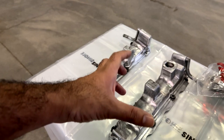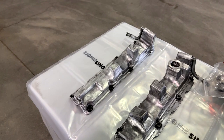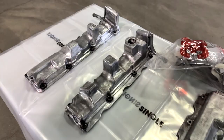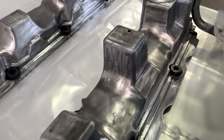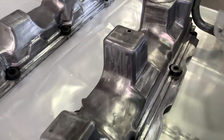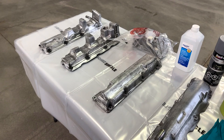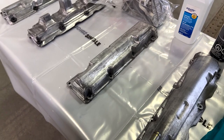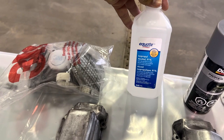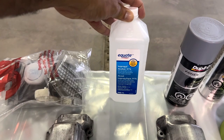But these two were painted, so I used paint stripper first to get most of it off, then I used my drill with a 180 grit sandpaper attachment to get rid of the rest. I also used a little sanding attachment on my Dremel to get in the corners, and then a Scotch-Brite pad to give it a once over. I probably went way harder than I needed to, but I like to do things once and do them correctly — I don't want to have to repaint these anytime soon.